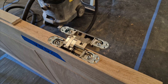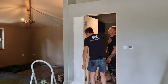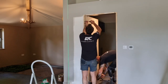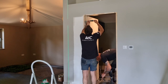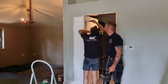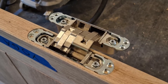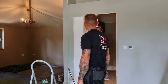It's just paralleling the sides out. So now what we're going to do is find the studs in the wall to fix our ply back to. The good thing is we've built these at 400 centres and started on that wall over there, so the middle of the first board joint is 1200. I can check that by looking at the bottom and seeing if I can see the plasterboard.